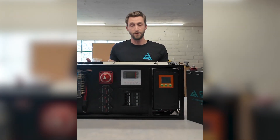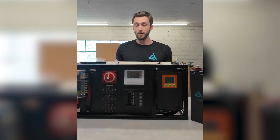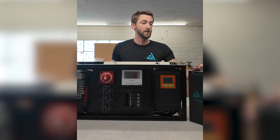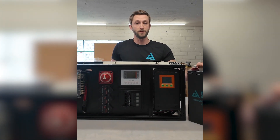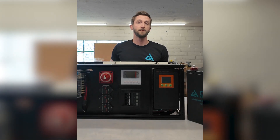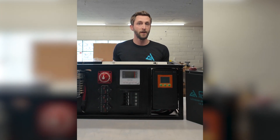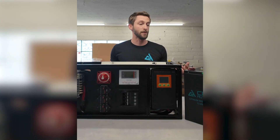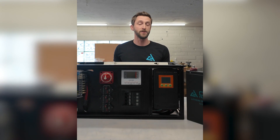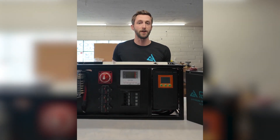For example, with a 3000 watt bench built system that can pull 250 amps at full inverter power, we make sure you always have at least two of the 230 amp hour batteries to provide a 300 amp output (150 amps × 2), so there's no restriction on the system. Another option would be three 100 amp hour batteries — again 300 amps total output — to make sure the system runs unrestricted.